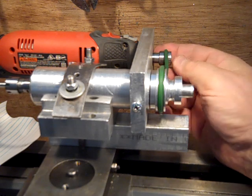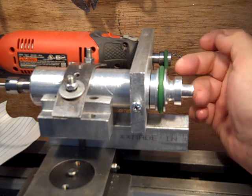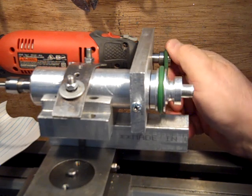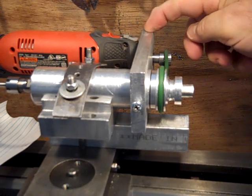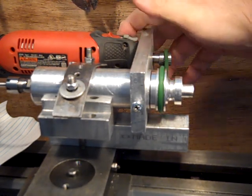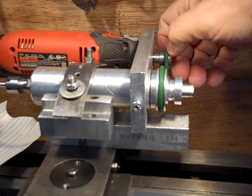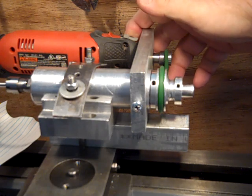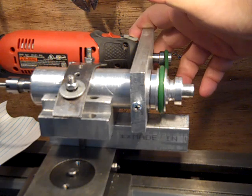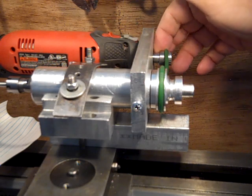I ordered some 3mm because this is actually a little too big. If I have it a little narrower, this won't rub where it crosses here so much. This is screwed into this aluminum plate. This particular unit — the neck is a standard three-quarter inch thread, not fine, it's regular — three-quarters by 11 or something. I just tapped that and screwed that in there. That's all that's holding it on. It's pretty rigid. It doesn't take any more. And the rest of this is just blocking it up.